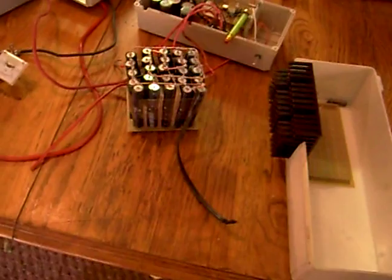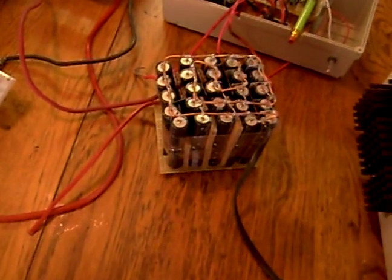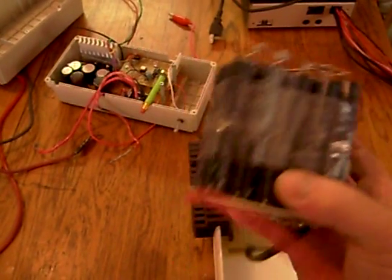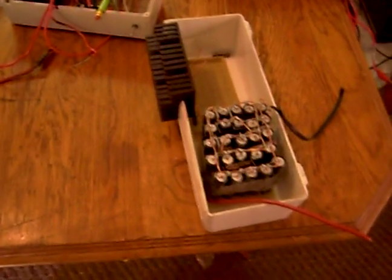When it's done, unlike the last one, I'll have a heat sink here — as you can see, the heat sink goes on the side of the box. These are the caps that go with it. It was tough to put that 14-gauge wire on without damaging the caps. The caps are two 50-volt caps, one standing on top of the other, so I can get a ceiling of 100 volts. This kicks out seven or eight amps of good raw pulse.